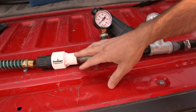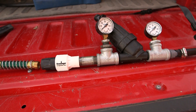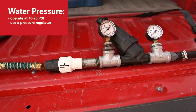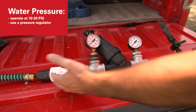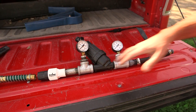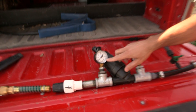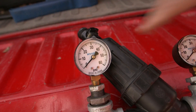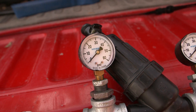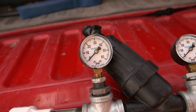Once you get out to the high tunnel, we need to have a pressure regulator. The pressure regulator reduces the pressure from our 50 to 60 psi static down to our operating range of 10 to 20 psi. Right after the pressure regulator I have a pressure gauge that operates from 0 up to 30 or 0 up to 60, and what the pressure gauge does is tell me that the pressure regulator is doing its job — bringing the pressure down to my operating range of 10 to 20 psi.